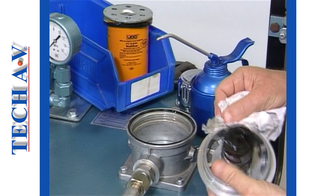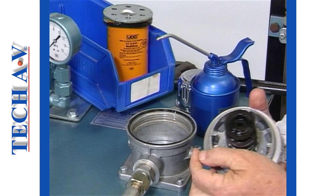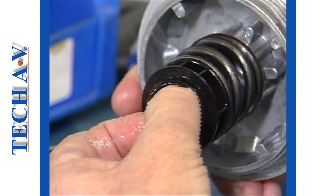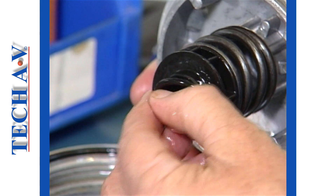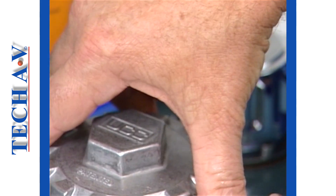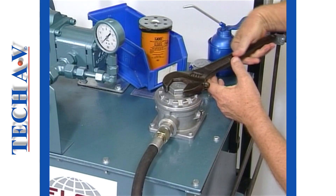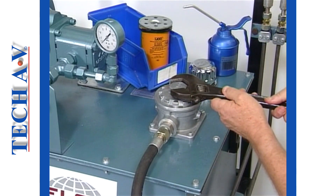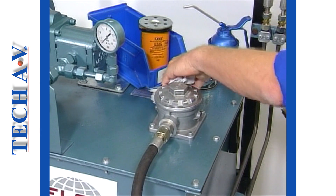The cover is now cleaned. Note that a smaller O-ring is situated in the cover — we must make sure that this small inner O-ring is in its position before the cap is replaced. The cap is now repositioned and tightened securely. As always, the task is completed after cleaning up any oil spillage.